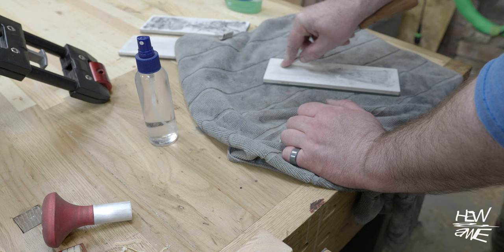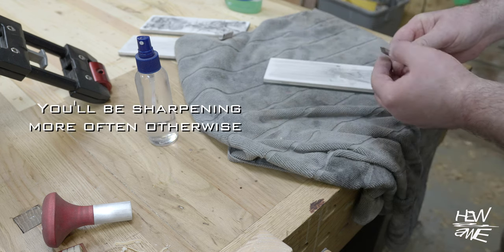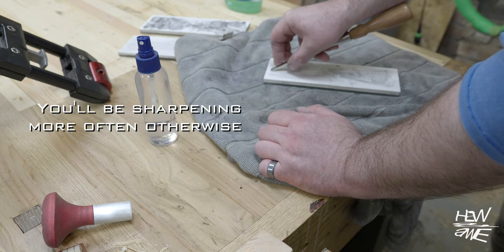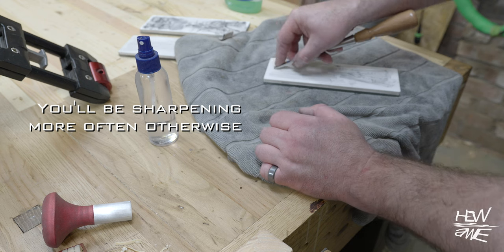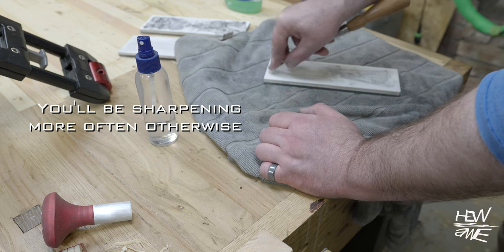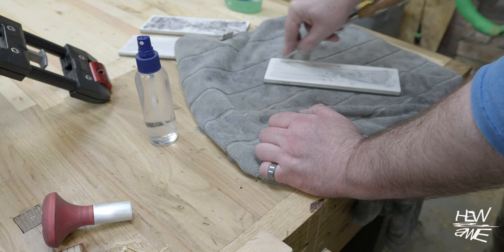But just so you know, hardwood and softwood angles on chisels should vary, in my opinion, because hardwood will round over at a low angle chisel very quickly, especially if you use a mallet. But we're talking paring chisels here though, remember that. You might be like me, a bit of a heathen. I like to beat on them with a mallet.